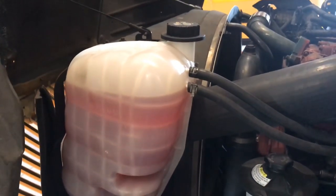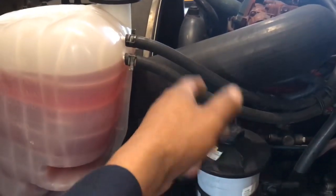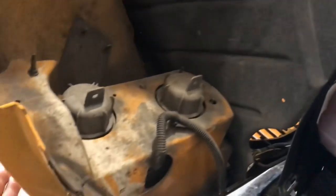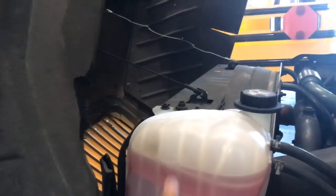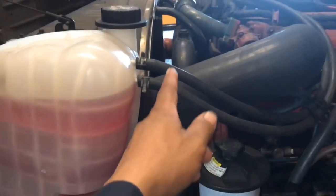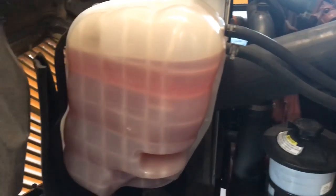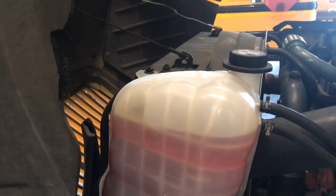On this one we drained the fluids first. After draining the fluids, the reservoir comes off, all the hoses come off. It's got two bolts holding it. On the other side, the hood has to have something propped in front of it to keep it from cracking open. We need to loosen those cables to extract the radiator. There are a couple of brackets here and there — everything stays: fan, pump, fan guard — only the radiator comes out.